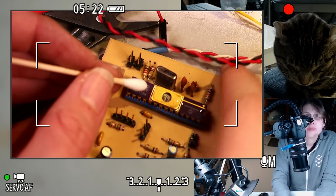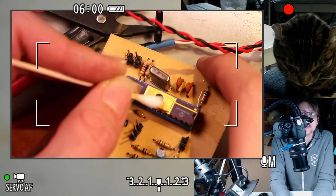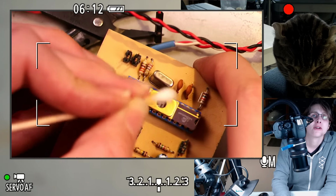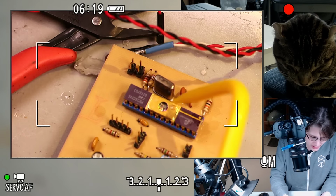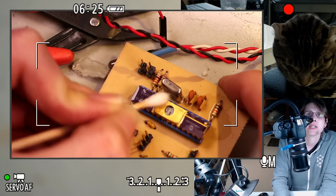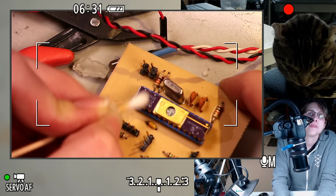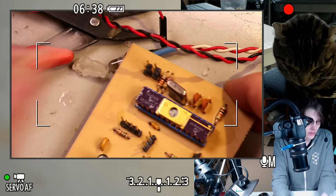And I also enjoyed some of the optical effects that you could do. By shining light on the die, you can change the amount of leakage in the analog to digital converter's input. So I had a program that would make the die itself into a light sensor just by charging up the analog to digital converter capacitors, a lot like you would do with a capacitive touch sensor. But instead of depleting that capacitance with anything externally, it would be the light effectively causing the capacitor to leak with a little bit of photovoltaic current. Because a solar cell is just a big slab of silicon. Right.